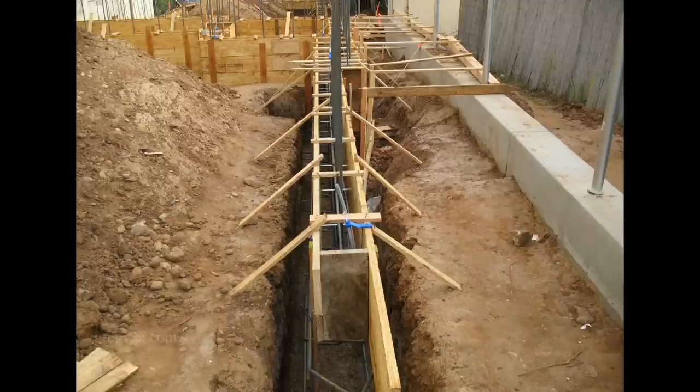Here's one of those videos I would like you to pay attention to, especially if you're planning on pouring any concrete in the future. The first thing you need to know about setting up forms is that they need to be firmly secured, braced off, and they need to be in the right spot. And they need to be straight. So just think of those three things as a nice place to start: first they've got to be in the right spot, second firmly secured, and third nice and straight.